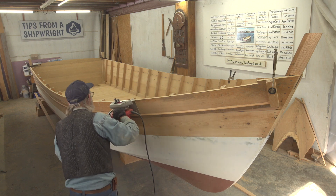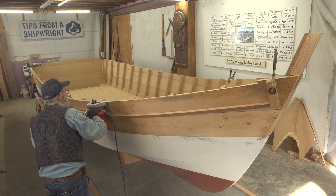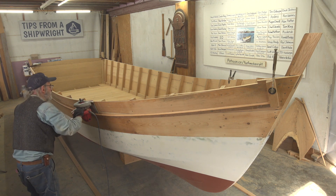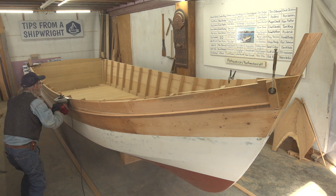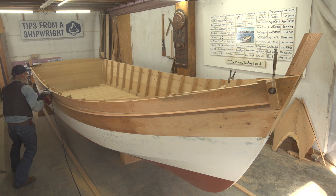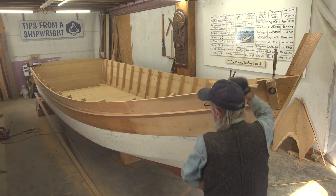I cut that one conservative in angle so I wouldn't mess up. But once we cut all the frame heads off and looked at it very carefully, I think it was a little bit high up forward, so I came down maybe an inch up forward and then faded right back into the same curve. I took maybe an eighth of an inch all the way down just to adjust the top of the plank and cut the frames at the same time. I've adjusted it not only in shear line up forward but also in bevel all the way down, so it goes from 10 degrees all the way down to 5 degrees at the other end.